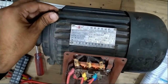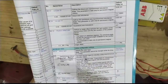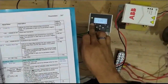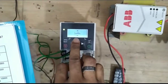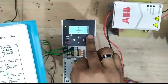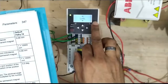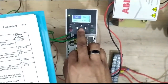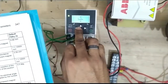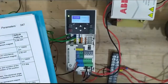Motor speed (RPM) is 1390. You can see the 99-group parameter is the initial state of parameters — you navigate down by joystick. This is asynchronous type, and the acceleration and deceleration times are also set here when you connect your VFD initially.